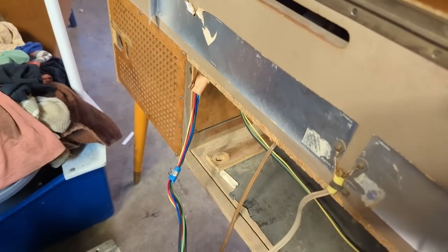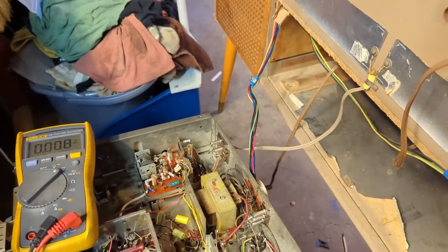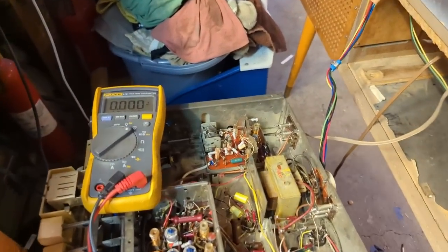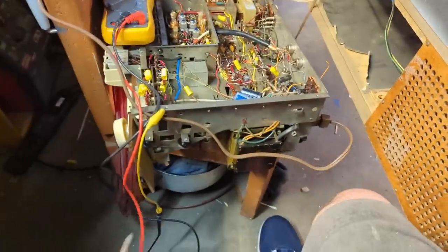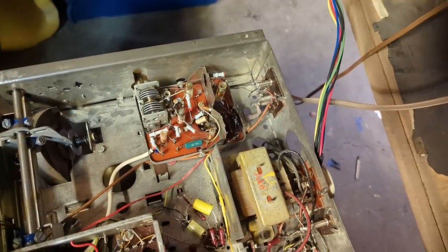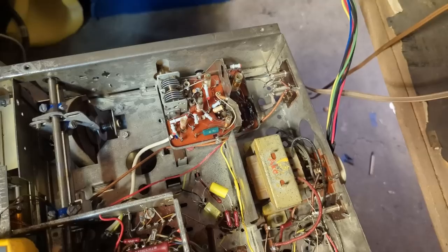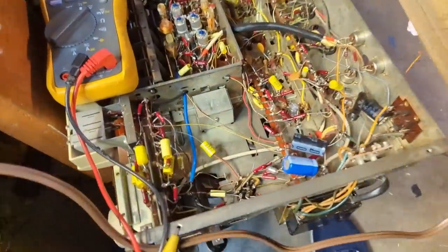Now, you see, I am getting some radio signal. You can hear a little bit, but that's with the volume cranked. So it's definitely got to be a lot better than that. So I just think there's not enough juice going through that tube, which is critical. Correction, my alligator clip had fallen off and I hadn't noticed it. So something smells hot. Anyway, pins number 1 and 6 are measuring fine. Nothing wrong with the pin voltages there.